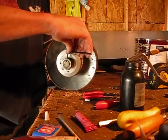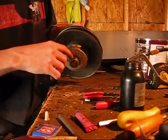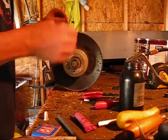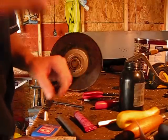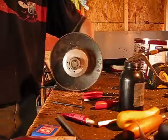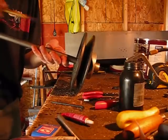When it comes to set screws with Loctite on them, you don't have to tighten them super tight, because if you tighten them too tight you just round out the set screw. Any of you who've ever had to take out a rounded set screw with an allen wrench know exactly how maddening that is — by the time you're done you need anger management classes.